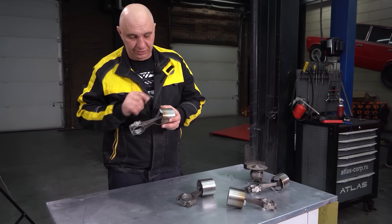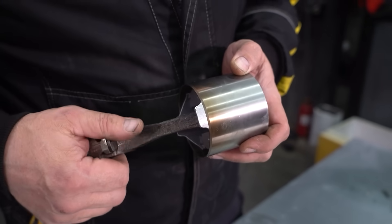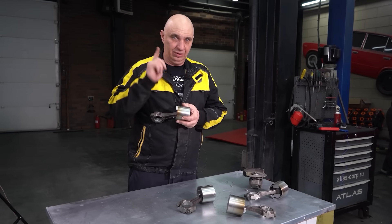These have gotten warm — there's no longer any icing. Right here we've got bits of skirt poking out, which we're going to cut off just to be on the safe side. We don't want these breaking off and rattling inside the cylinders.